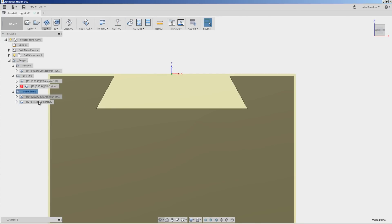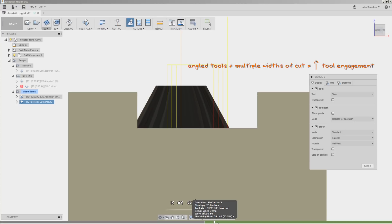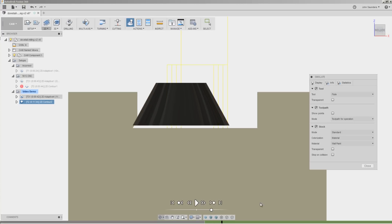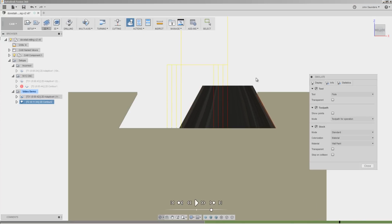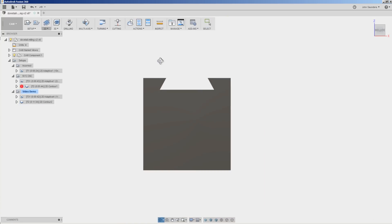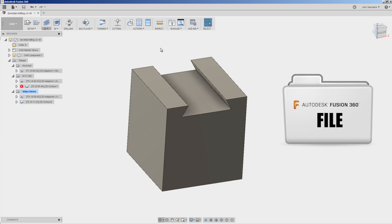The only thing to keep in mind is that with any angled tool — whether turning threads on a lathe or a dovetail cutter — each width of cut increases cutter engagement. That first cut wasn't removing much material, really just the tip of the tool. But by the third and fourth cut, we've got a lot more engagement along the sidewall, which increases deflection, may induce chatter, and asks more of your cutter or machine. So keep that in mind — you may need to decrease the width of cut or slow down your surface footage. Otherwise folks, hope you learned and enjoyed. This Fusion 360 model is available — card here to download it from the NYC CNC website. Take care, folks. See you soon.